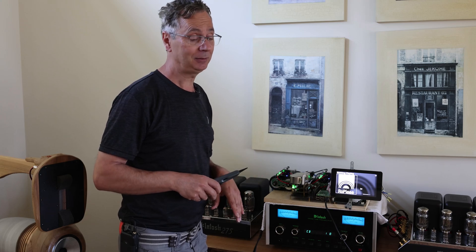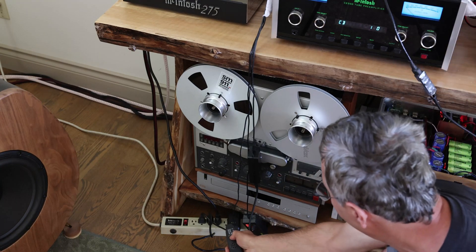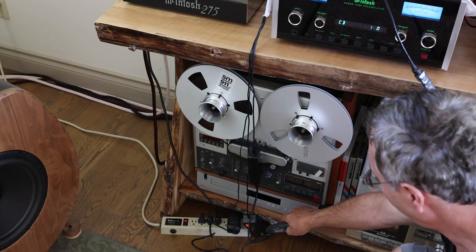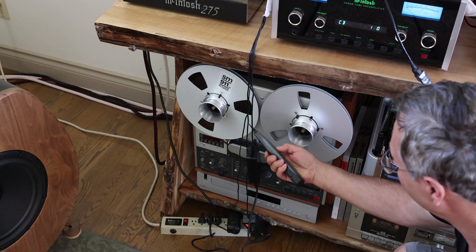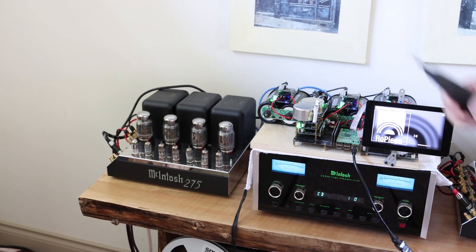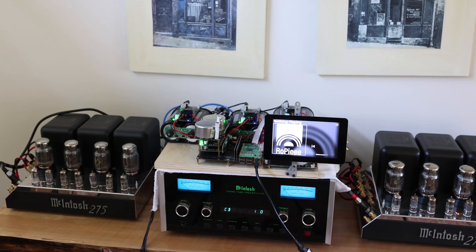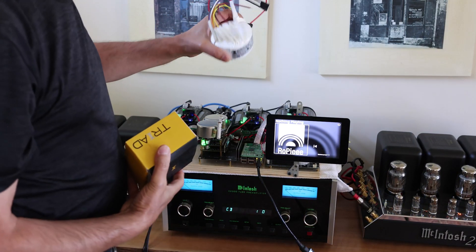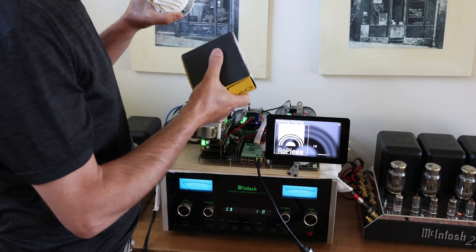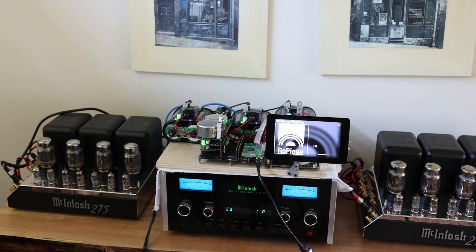Here I've got one here, one here, and one here. This one hums a lot, and this one has that tick, tick, tick — not one of the better ones. Look at that — it goes right through the cord all the way to the top. So instead of these switching power supplies, I'm going to be using toroidal transformers. I've already bought three of them, and each one can have a dual output, so these can supply six — I need five. So they will supply the entire DAC.